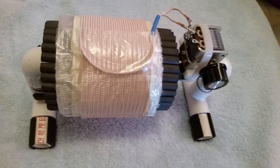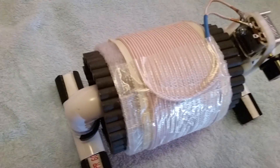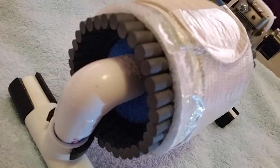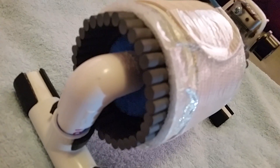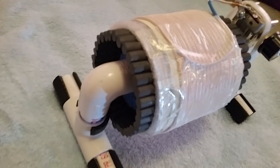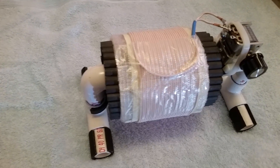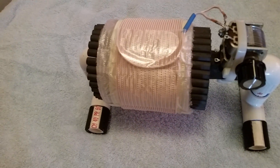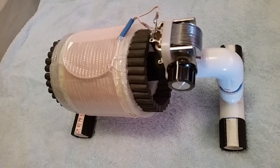This particular FSL uses 32 of the Russian surplus 140 by 8 millimeter ferrite rods. These rods are still currently available on eBay for anybody that wanted to build one, and if you shop around you can get about 32 of these rods at around $60 shipped to the USA from the Ukrainian ferrite sellers.